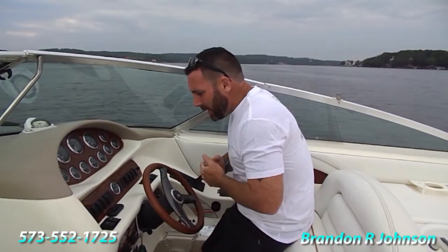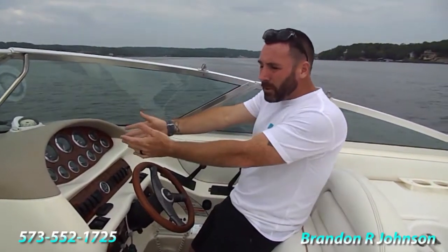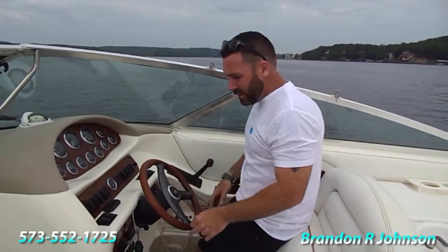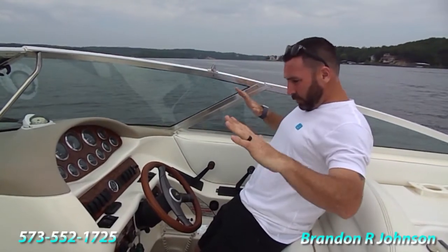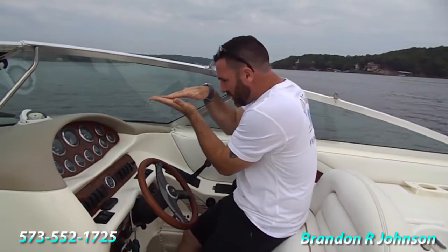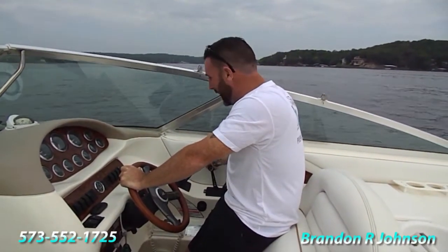It's going to happen. Now, let's say it's rough as sin on the water. Waves are choppy. It's just annoying. You know, get the boat on plane. Obviously, in the video, like I showed you, it planes and cruises smooth at 30 miles an hour. Just go ahead and put them both down all the way, and it drags the boat, okay? Drags because it pulls water in the back, so it forces that nose over and just runs flat. Instead of slamming and slapping, it's just going to plow through the rough waves. It's not a very efficient way to cruise from a fuel economy standpoint, but it will take a day that's miserable in terms of the water being rough and make it very smooth and make you very comfortable and confident.